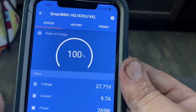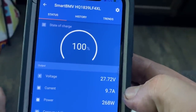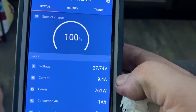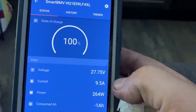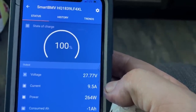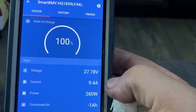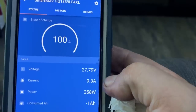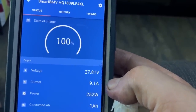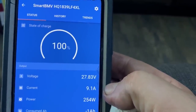I'm running the air conditioning right now and it's a cloudy day, and I'm still charging at 9 amps on the batteries on top of the air conditioning running. That's great that we can do it on a cloudy day - we used to be able to do it on a sunny day but not on a cloudy day. So we can maintain 100% battery status on a cloudy day while running air conditioning with the solar panels. And that's only four of my new eight panels hooked up right now, so I'll be able to boost that even more - she'll be able to run the microwave and the air conditioning at the same time and still hopefully bank power or come close to breaking even on cloudy days.